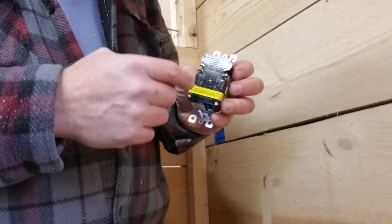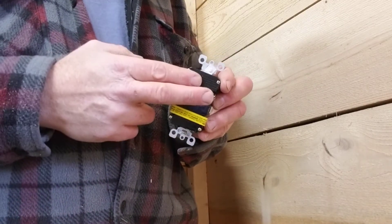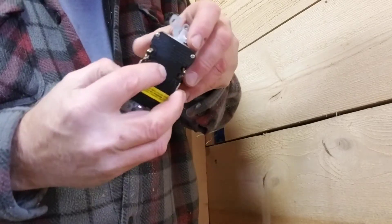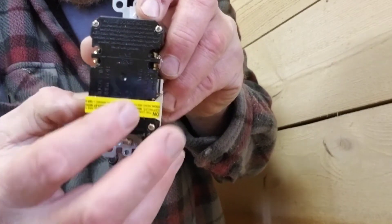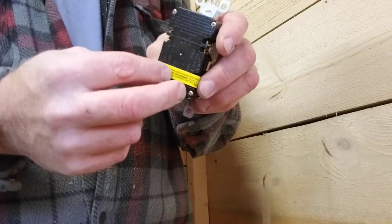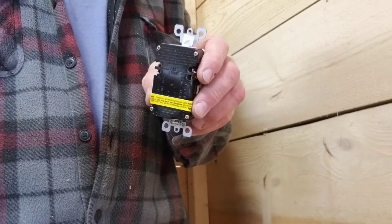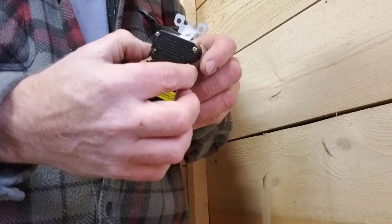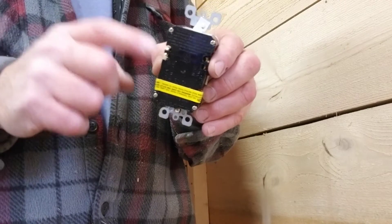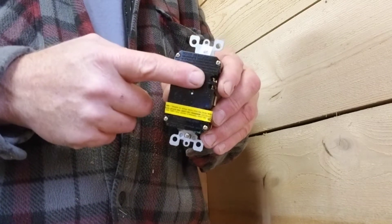The other thing to point out on a GFCI is that power goes in and comes out. If you wanted six receptacles protected by one GFCI, you'd come into the GFCI — you can see the buttons on the front — on the top side which is labeled 'line,' and then you'd come out of the bottom labeled 'load.' Power must flow in the right direction through this, otherwise it can't monitor what's going on downstream. If you feed it incorrectly, it won't work at all.